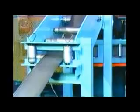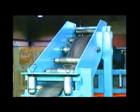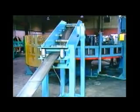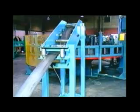The strip exits the accumulator at the inside diameter or inner helix. The helix is comprised of a series of idle vertical rolls set in the inside diameter. A set of angularly placed rolls guide and support the strip to the upper takeout point. The rollers are mounted in anti-friction bearings. Prior to the strip entering the mill, it will go through a pass line compensator. This compensator stand supports the strip at the final point of the exit twist length and will take the strip from the exiting pass height of the Superloop and redirect it to the entry pass height of the mill.